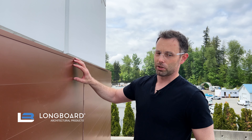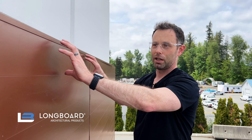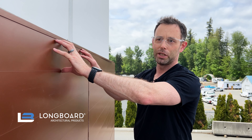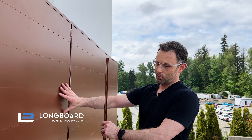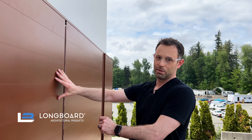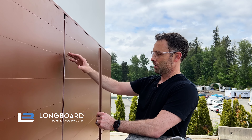Another thing to note is we didn't have any mechanical fasteners through this plank itself. This leaves the plank free to expand and contract with thermal movement. The last step on our wall — whether it's panel board or TNG planks on a cladding application — we're going to install our U-Reveal cap.